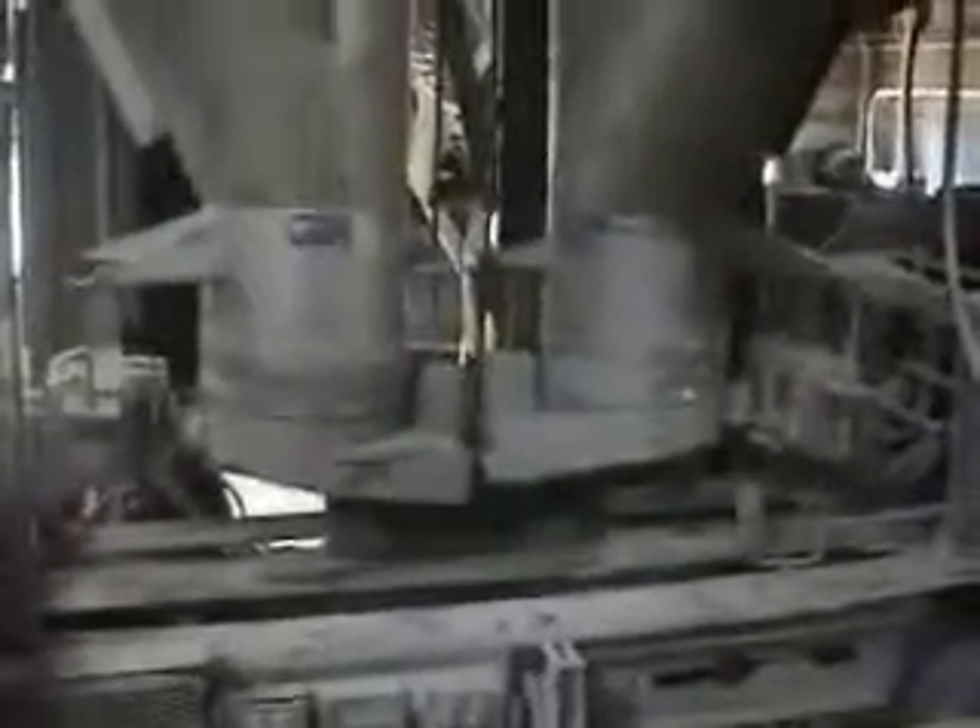We're now at plant one in Monroe. Here are a couple of the receiving bins, and here are a few more over here — it's quite a squeeze to get these units to fit in. The feeders go down underneath; it's hard to see. This is where the material is pneumatically conveyed over — you can see the conveying line right here. We're looking at the white ceramic elbow in here; there's one that comes over, makes a turn right here, and goes up into the receiving bins.